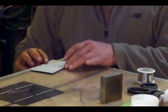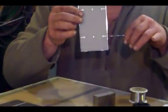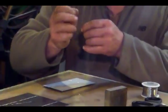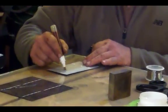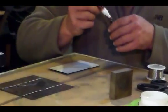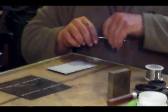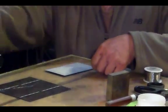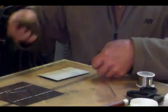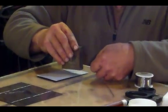When you get ready to do the back, the same thing applies. On most solar panels, your rear tabs are going to have little boxes or blocks or lines in the back that you're going to want to follow. You grab another tabbing strip, your flux pen, and I just put a little mark on there for flux. I use the same method as I do on the front, but I only have to hit three strips on there. I like to use my third hand, which is my little jeweler's block — it's a little piece of metal, not heavy enough to crack a solar cell.